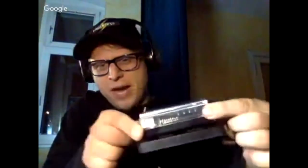So let me show you the hardware. What you have here is a Raspberry Pi in a case — it's a Raspberry Pi 3. You have an LCD on the top where you can see status information and it helps you with setup, and you have a one terabyte hard drive. This is all custom stuff you can order from Amazon. On the GitHub there's a shopping list you can go through, order all the parts, and you have everything you need for a weekend do-it-yourself project. In the end you have a Bitcoin full node running on your own hardware and a Lightning node based on LND. This gives you a basic setup to get started with the Lightning network in a really self-driven way — run it from your home.